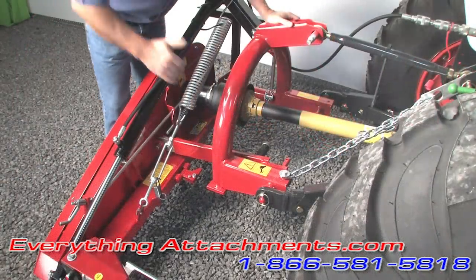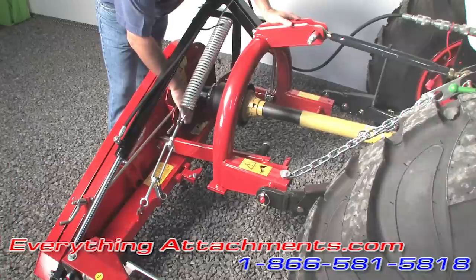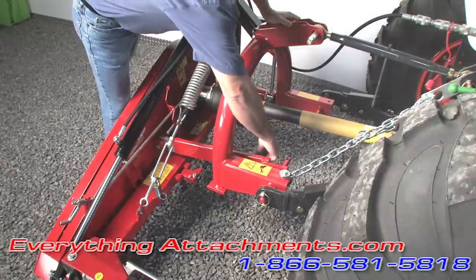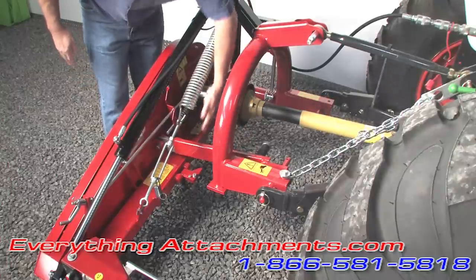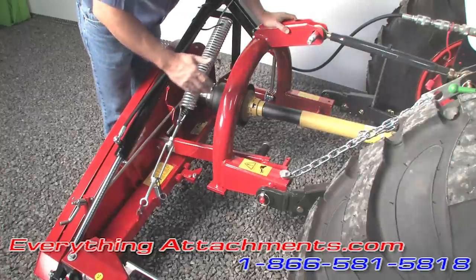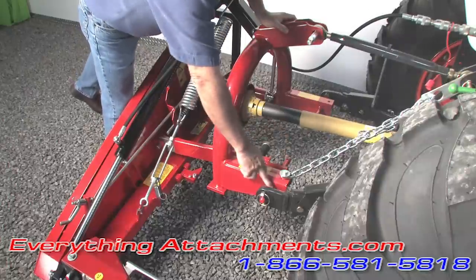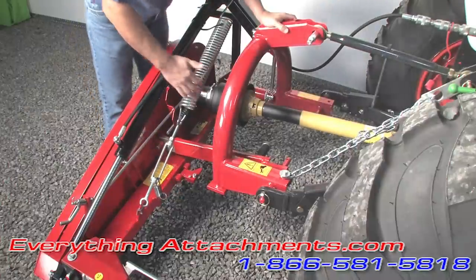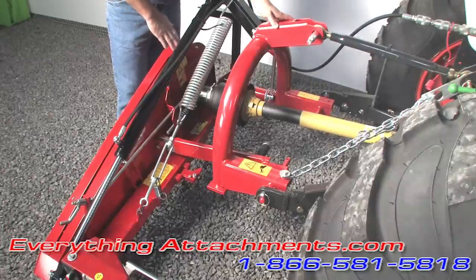Now that we're down in the guts of this thing, we want to show you a few more components. You've got a really high tension spring right here that's going to adjust the three matched belts. You've got a slide right here with a big spring mechanism so if you hit something in the field it's going to let that slide all the way out — over a foot of travel to relieve pressure on the end. You also have dual hookup, so if you have a smaller tractor you can hook up on the inside instead of the outside. It comes with the bushings here, tension for the end of the boom, and this is all casted — a very heavy duty piece meant for a lot of hours of use in the field.